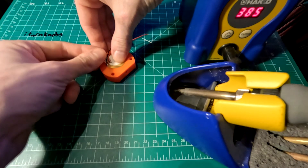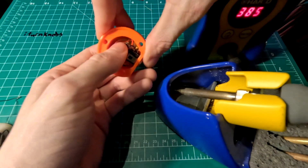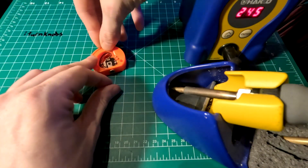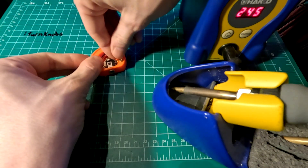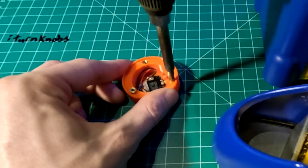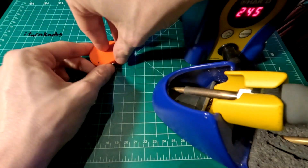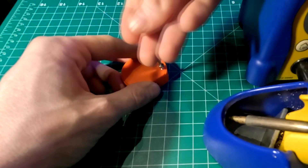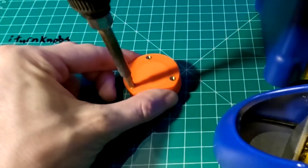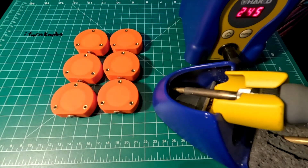Initially, I tried configurations with the resistor omitted, but I got a lot of false triggers, so I think it's required for this application. With all our bits crammed inside a puck, I'm going to upset some of you by adding a few drops of cyanoacrylate superglue to solidly mount the piezo in place. We can then insert some M3 threaded heat inserts and install the lid. I used what some might say is an excessive amount of these heat inserts in this project, but I love using these things — it's just so satisfying to set them into plastic. With one puck completed, we just have to repeat that five more times. And just like that, we've got all our drum pads.